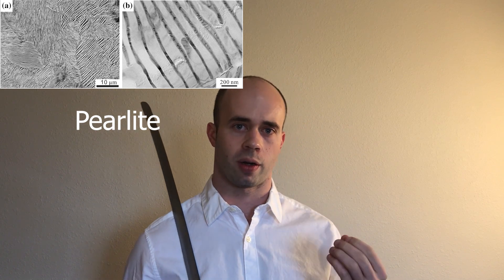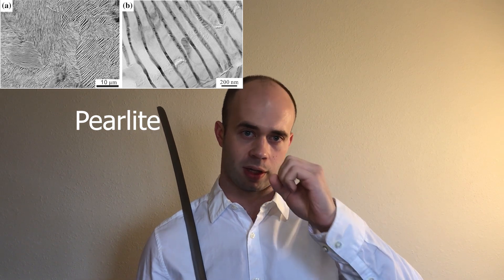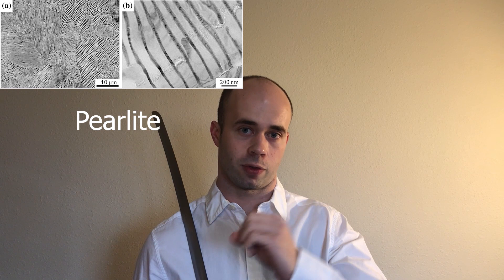What's common is what's called pearlite — a form of steel where the carbon atoms have completely separated from the iron atoms and exist as pockets, or pearls of carbon. Pearlite is one of the weakest forms of steel because the carbon is clumped together in certain sections rather than evenly distributed. To break down those carbon clumps, you add heat. When the steel gets hot enough, it transitions from pearlite into what's called austenite — a state where everything opens up and the carbon atoms distribute themselves more evenly within the matrix of iron atoms.